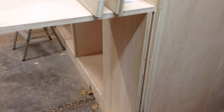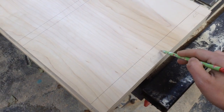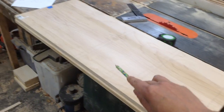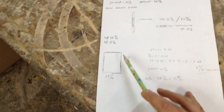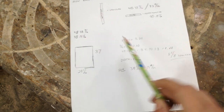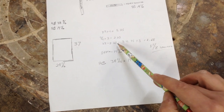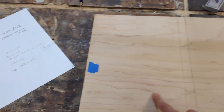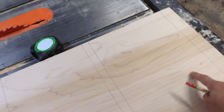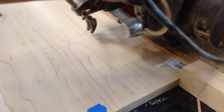These inner pieces are going to sit on the inside edge of the face frame, and I'm going to cut dados for all of my shelves. The top part accounts for the face frame that overhangs the top edge of the cabinet, and then I simply split this up - it's fairly simple math, but you have to account for the thickness of the plywood. You could pause on these dimensions to get a closer look, because with inset drawers it's really important that all these front faces are the same size, or the eye will pick up the differences very quickly.